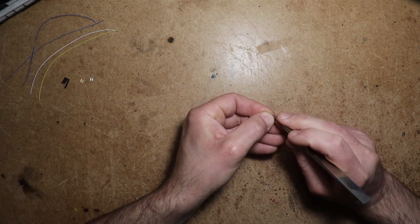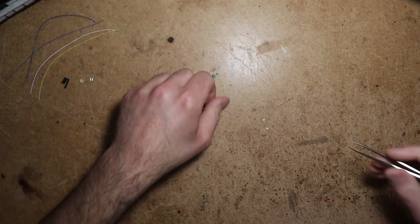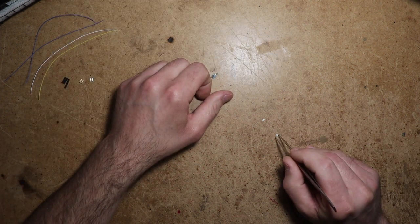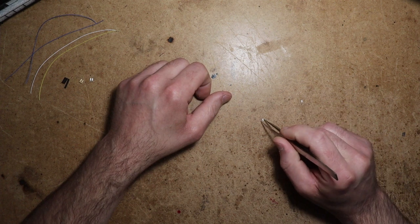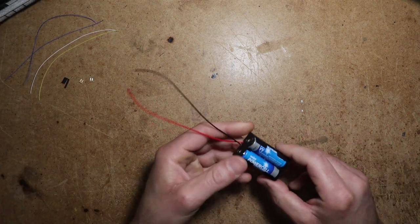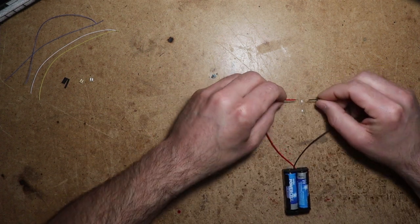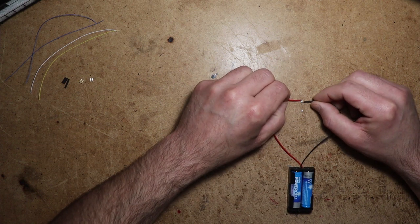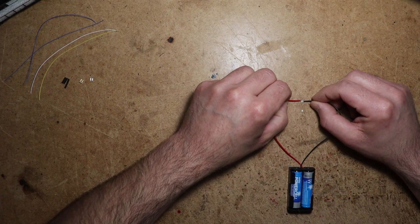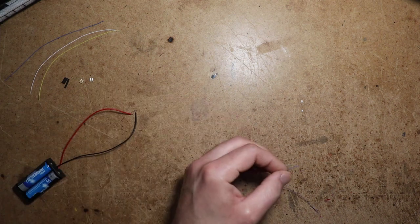So now we're going to solder the wires to the 1206 LEDs, and to do that I use common double-sided tape. Just poke them on there. And I will test these quite a bit. I've got a AA holder with wires here. These premium LEDs, the short pad is the anode, the positive anode. So you just want to make sure that they're working out of the package.